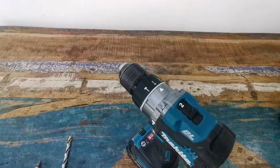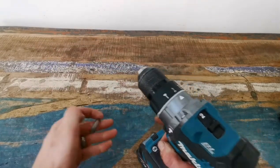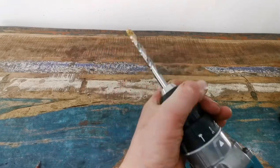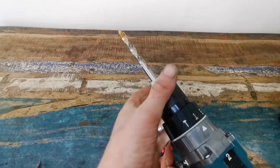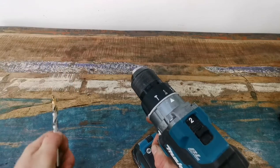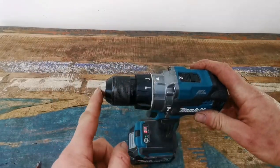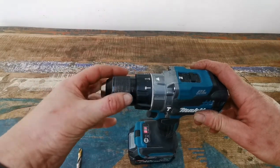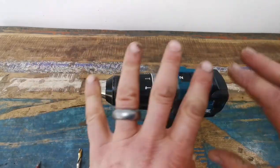But that's not what I do anyway. What I generally do — I'll think I'm going to change the bit, I'll put it in reverse and then spin that back. And what happens is this drill is so powerful that if you're not careful it runs the jaws right back into the back of the chuck and it seems like it's jammed.